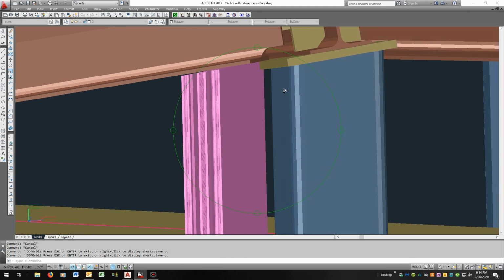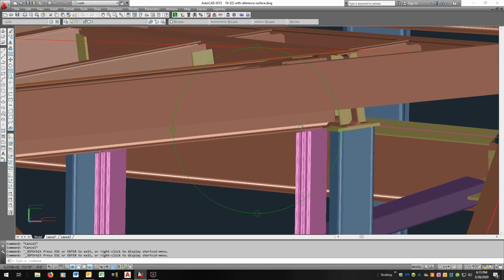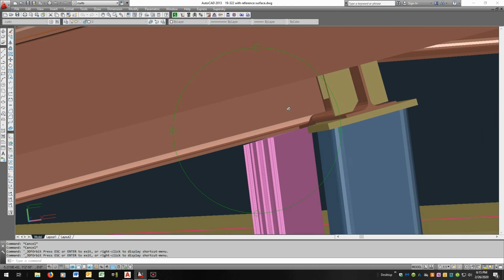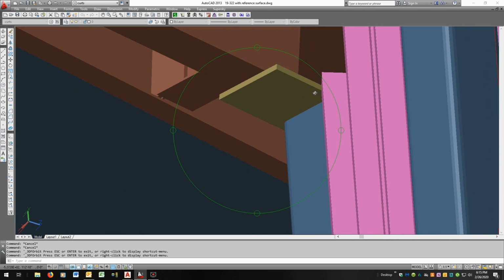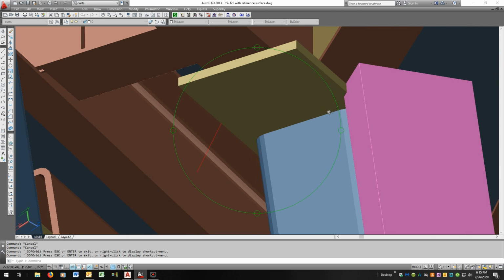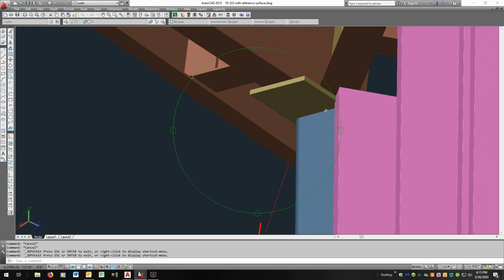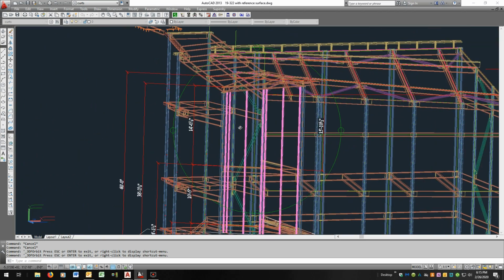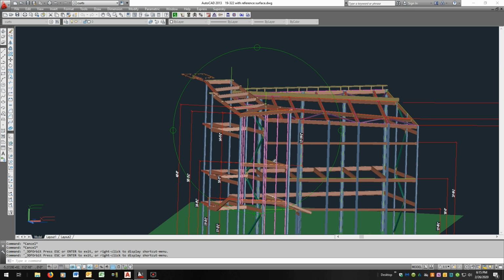Unfortunately, over here, there's a problem that I don't know how anybody can fix. What goes on is you've got one beam coming through that connects to the column, and the beam that the skylight connects to connects to the first beam. That base plate blocks the skylight connection. We would be cut a little bit below the beam, but we still have to put a connection point into that same space. So I'm not sure what on this backside can be altered to make room for the skylight connection. We're going to this beam, but the tube can't hit that plate. So that's a problem on that one column. Please look at, on the wall side, that connection and these four, where these knife plates and base ledges occur. Those will have to be changed somehow.